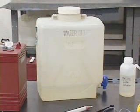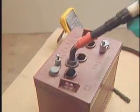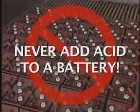Do not use water with a high mineral content — you should use distilled or deionized water. Be advised that electrolyte is a solution of acid and water, so skin contact should be avoided. Lastly, never add acid to a battery. Depending on the local climate, charging methods, and applications, Trojan recommends that batteries be checked once a month until you get a feel for how thirsty your batteries are.